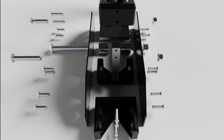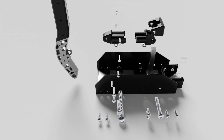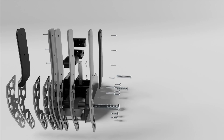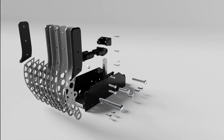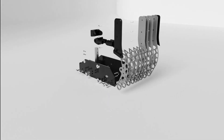The main body is constructed of two plates of 3mm steel that have been laser-cut for precision fitment. The handle is constructed of multiple layers of polycarbonate, sandwiched between two pieces of 2mm 6061 aluminum, fastened together, and then topped with two 3D-printed pieces to make the grip. The fasteners range from M3 hardware all the way up to M12 hardware.